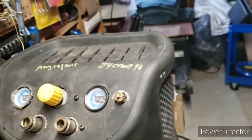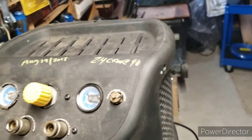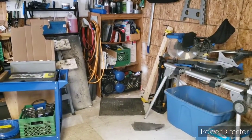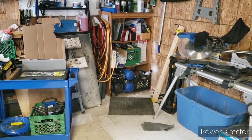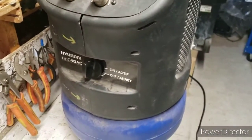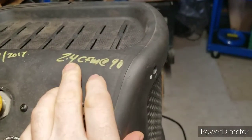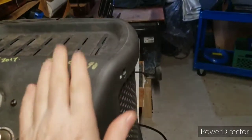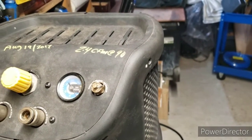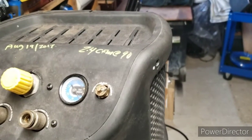I'm going to say that those CFM ratings are a bunch of hooey, and I'll tell you why. I'm not going to pretend I know how to convert SCFM to CFM — honestly, I contacted the manufacturer of my Campbell and Hausfeld compressor and they weren't even clear on it. But I'll tell you what I think: it says 2.4 CFM at 90 PSI, and I have a couple of tools that need 2.2 CFM at 90 PSI to run continuously.